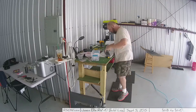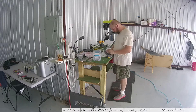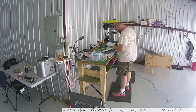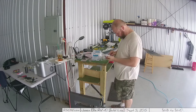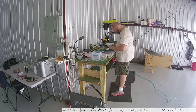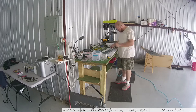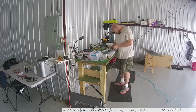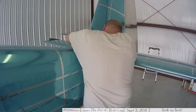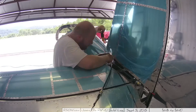At this point I've got the servo on and the linkage hooked up to the bell crank, and I begin the installation of the trim cables themselves — long black cables, which are cables within cables within cables, kind of thing. Pretty cool, interesting how they work. I was hoping I'd be able to be sneaky and not take the vertical stabilizer and rudder off — yeah, no way. You have to take those off; there's just no way to do this work with those still on.